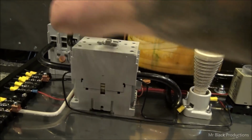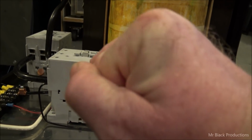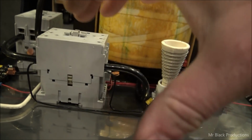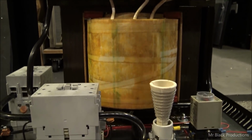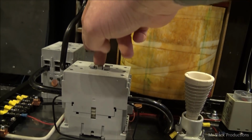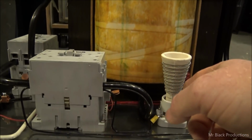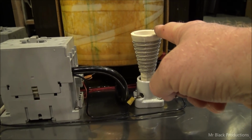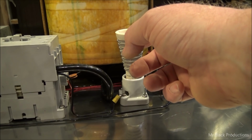Well, when the hose is on, when this contactor is down and this contactor is down, the hose goes from being this tiny little straw to like a 6-inch pipe, and we can flow a bunch of electrons into the transformer. The transformer in turn can spit out a ton of electrons into the rectifier board, right? Okay, so when we don't have this closed to complete the circuit to the primary side, we've stuck a resistor in there, per se. This is a nichromium wire that's on this conical heating element.